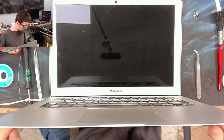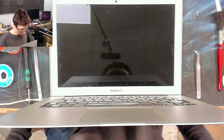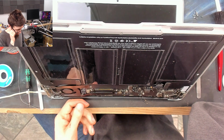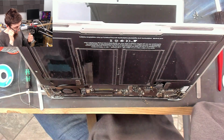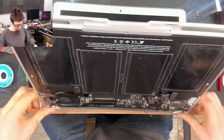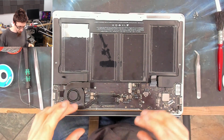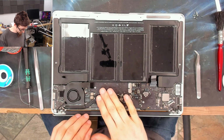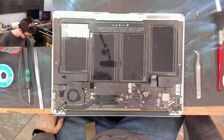Here we go. Power on. Fan spin. CPU is going up in flames, man. It's burning hot to the touch. No, that's dead. All the power rails are coming on, which is satisfying the board enough to switch on. However, the CPU doesn't actually function if you give it power, and it's just drinking up as much voltage as it can take, it seems.